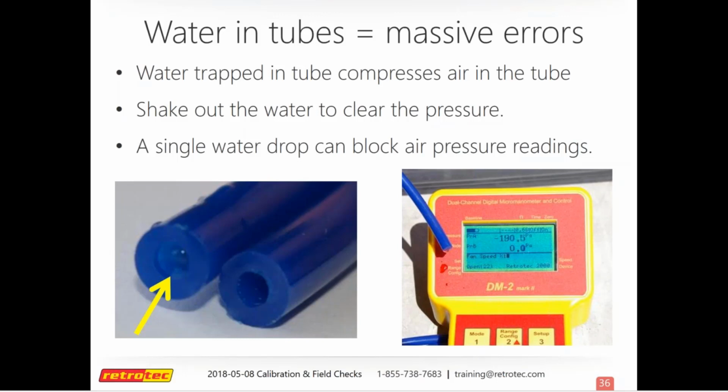I can remember one time I was doing a duct test and the supplies were in the ceiling and I didn't realize it, but I got there just after an installer left and he was doing some last minute air sealing on the inside of the boots on the seams. And so as I got everything set up, I ran my test, everything was set up right. I wasn't getting a reading, couldn't figure out why, checked out everything in my test setup, took everything down, put everything back up. And of course, the last thing I checked was my reference hose that I plugged in to the duct system to check the duct system pressure through the supply. And as I pulled it down, there was a big glob of wet mastic on it. And so of course I was going to throw my reading off. So it doesn't take much.